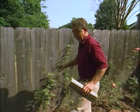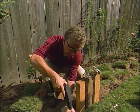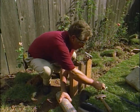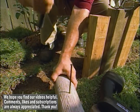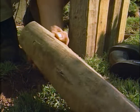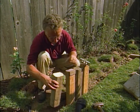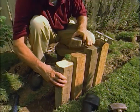As we nail these along, the next step is to drill a pilot hole in our timber so the nail goes straight through exactly where we want it to. We're using six-inch pole barn nails, which are pretty hard to drive through a piece of wood. In order to make sure that we have the same rise and fall on our timbers, we've cut another section of timber, lay it on top of our post, and get the top even with the last one — that gives us the same rise and fall on each timber.